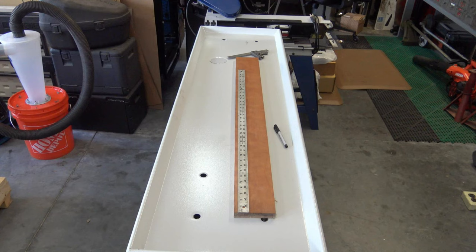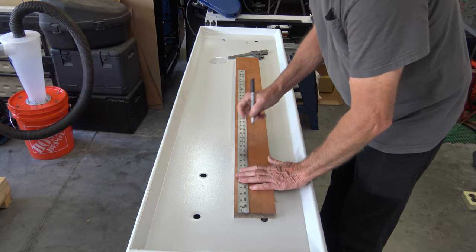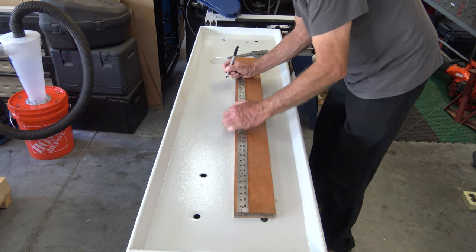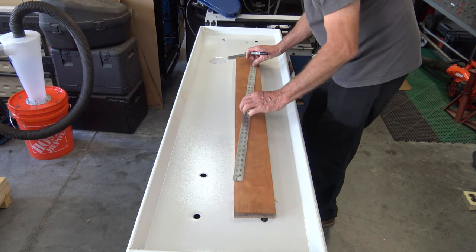This is day two of the new lathe. The manual says to cut four pieces of wood, 3/4 inches thick and 10 inches long. The pieces of wood are used to protect the lead screws and the DRO scale while you're lifting the lathe with lifting straps.